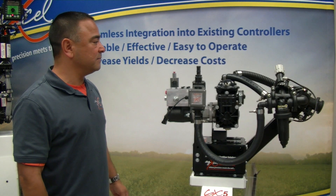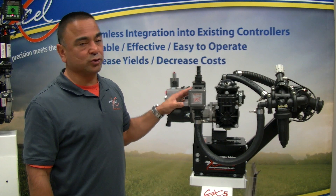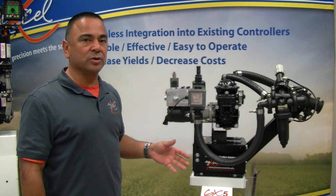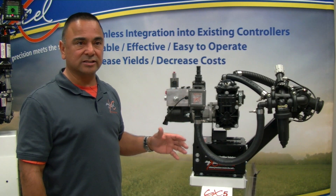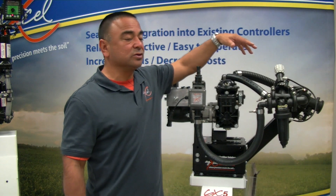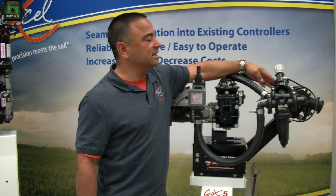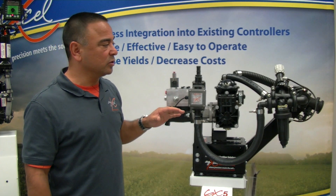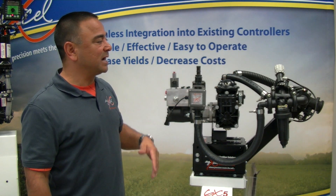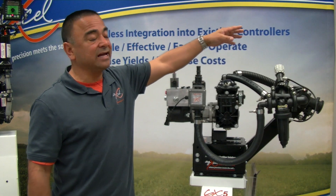The bypass valve is on the system because these pumps work extremely well at five gallons per minute, and the D70 can do four gallons per minute well, but any lower the pump struggles to achieve lower rates. The bypass valve bypasses some liquid in the system so it can go to lower rates. If you're trying to get down to two gallons per acre on a D70, we send liquid back to the tank, bypassing more to achieve that lower rate. This gives you a really broad range for solution or fertilizer application by utilizing the bypass valve.